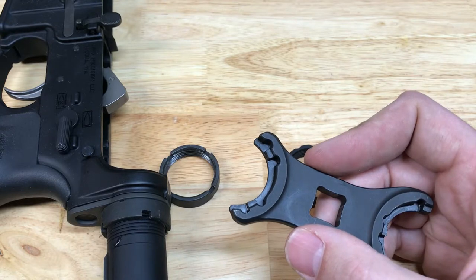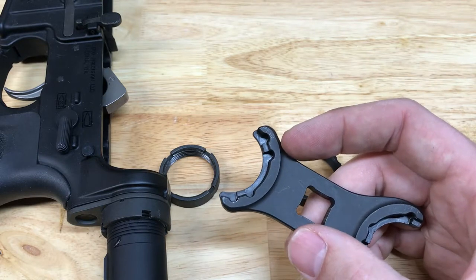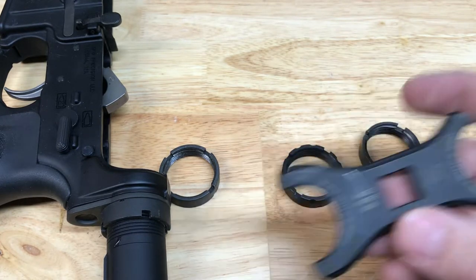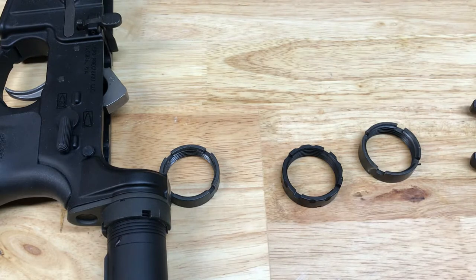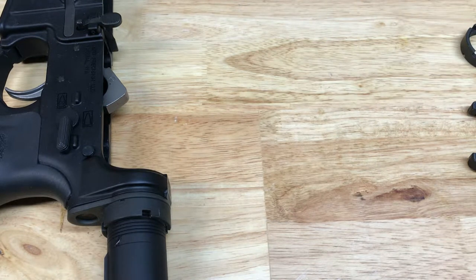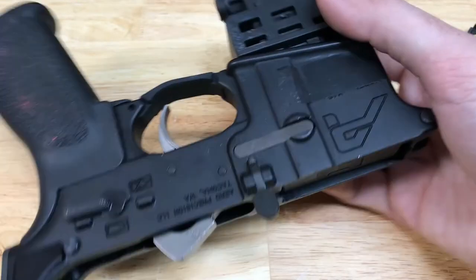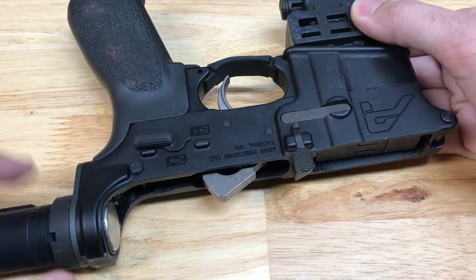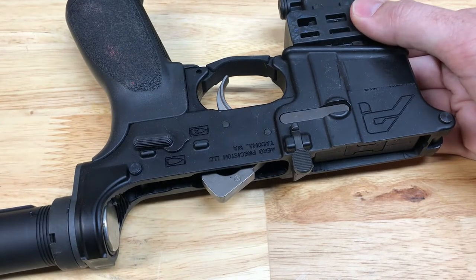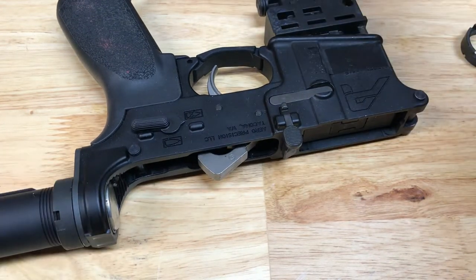No matter what you're doing, you can get at least a couple of the notches engaged as you're rotating up to spec — it's an incredibly well-made product. While you're doing that, you need to hold your lower securely. You need a block that holds it securely. The common inexpensive lower receiver block can work, but if you attach to the lower receiver and torque back there, you're introducing a lot of stress through that whole hollow aluminum assembly, which isn't necessarily preferred.